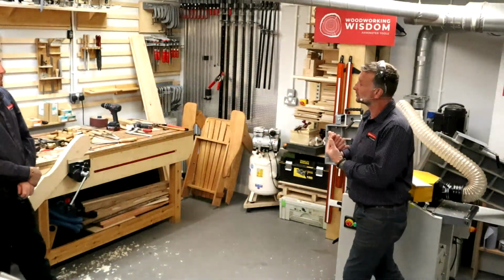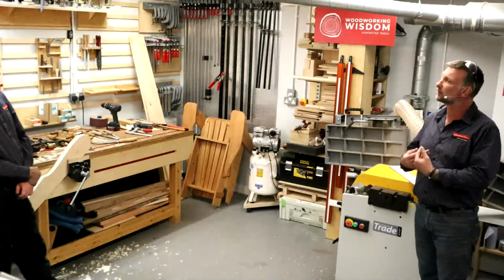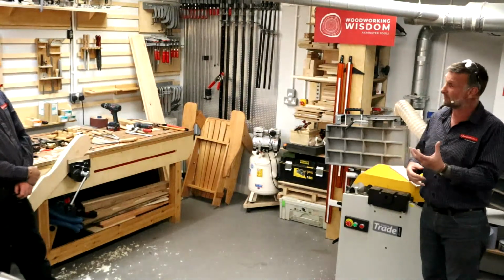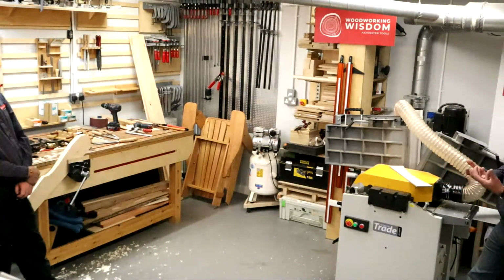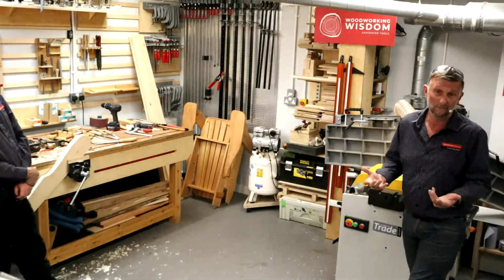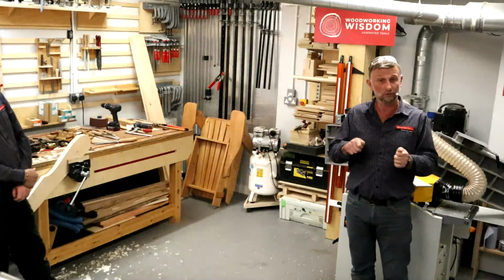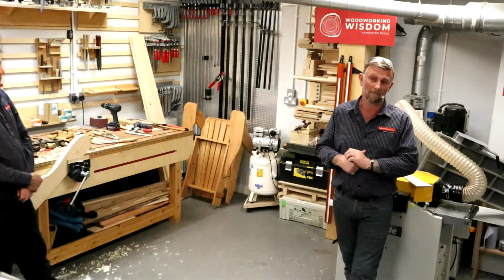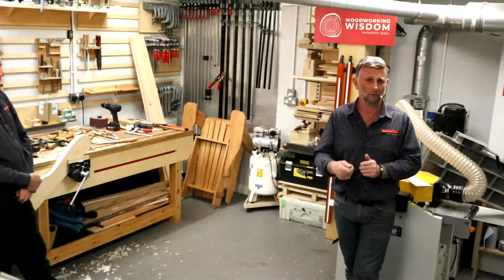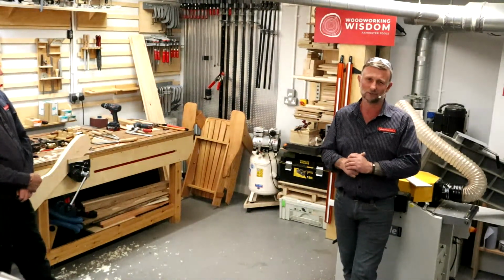Okay. Yeah, so we just had a comment from Chris about cutting treated timber indoors. And it's maybe not the health and safety, maybe not the best thing to do. I mean, personally, I'm always masked up anyway. I always use good extraction. And I think you really got to treat that stuff like some of the nasty hardwoods. Make sure you protect yourself. No dust at all is good for you. I know with treated timber now, the chemicals used to treat that timber are far less nasty than they ever used to be. But you've still got to protect yourself. Certainly not good if you burn it, if you chuck it on the fire. It's not good to burn it on your indoor fire at home, on the wood burner. It's not good stuff, really.